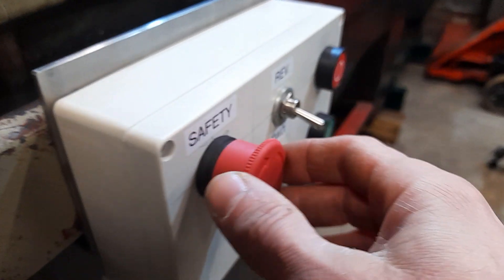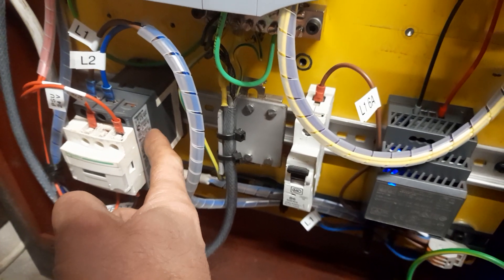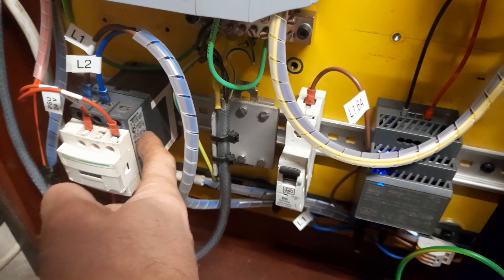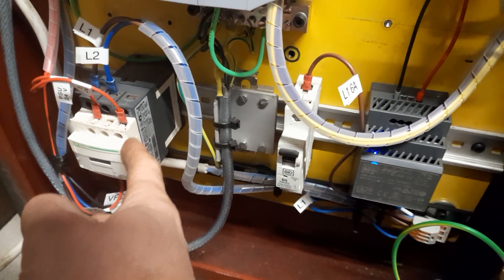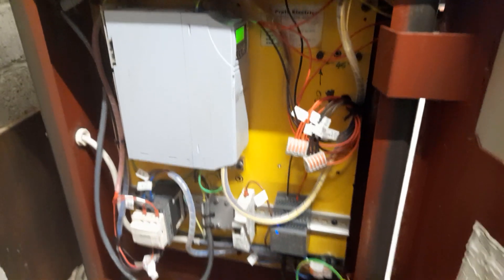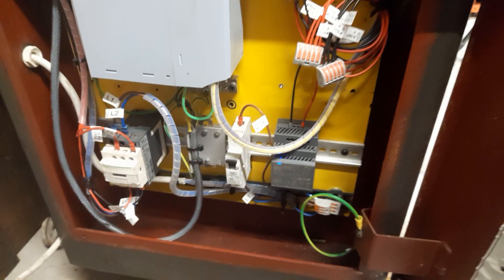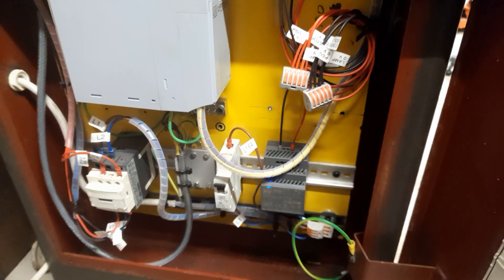It's really not bad, and if I twist this knob it pops out — the light is on telling me it's active. That enables the power to the VFD. We've got the primary contacts for the contactor, and then the auxiliary contacts, which I use to turn that indicator lamp on. I'll most likely post another video showing the circuit diagram and a simulation showing exactly how this works. Thanks for watching.